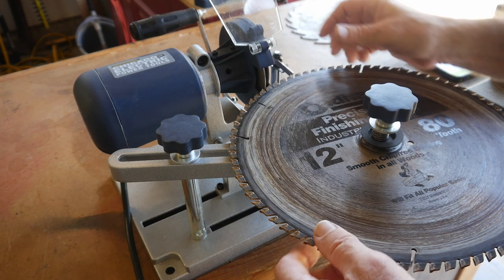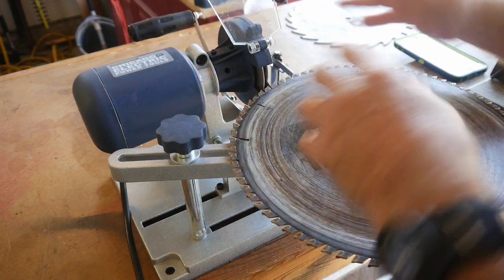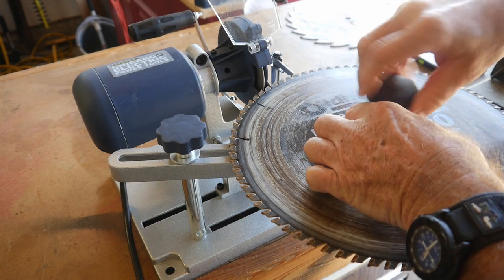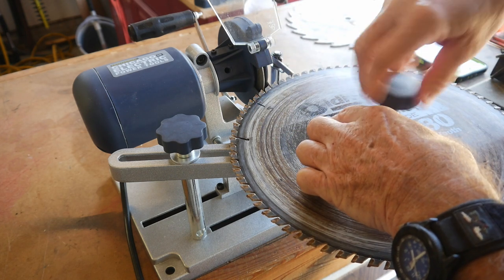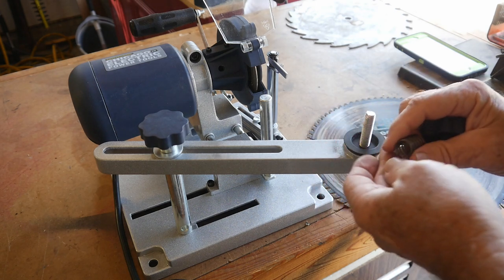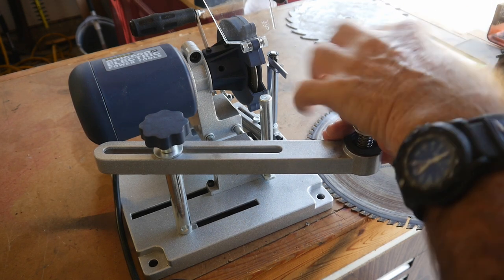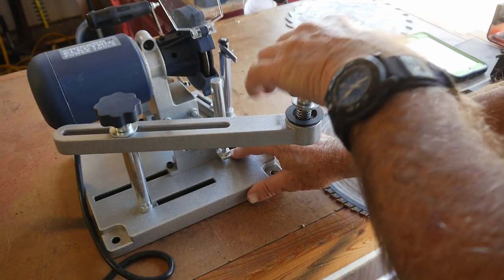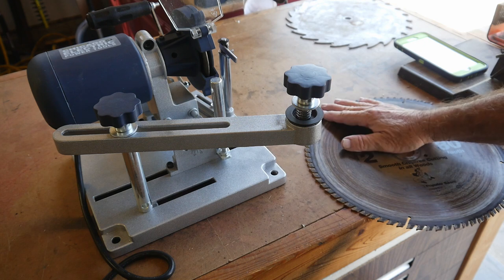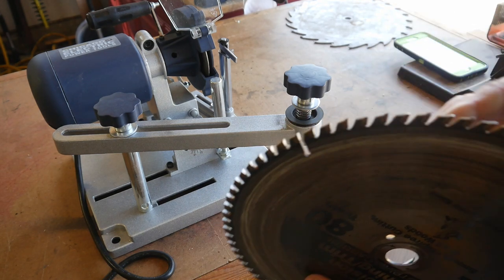I've gone all the way around just one time, because I gave each one of these teeth a really good pass. Stop the machine and now we can unload the blade and put her back in the saw. This blade was virtually smoking when it was going down through a 2x4 — a soft pine 2x4 — and she was smoking. A soft wood like that, this blade should just walk through like butter, so it was quite obvious it needed sharpening. I saw a lot of sparks flying and a lot of dust flying around, but the saw blade has gone once around and you can see the shiny on all the blades now — they all have a nice shiny look where I sharpened them.